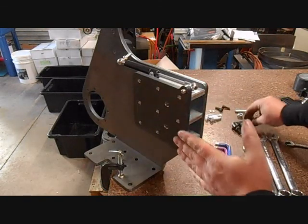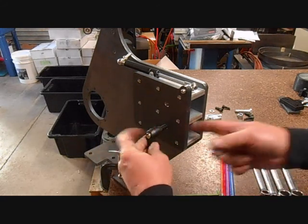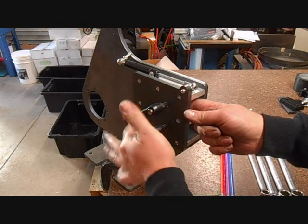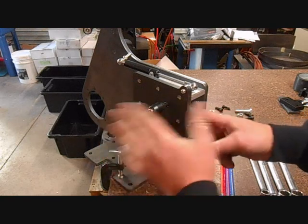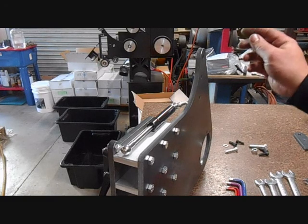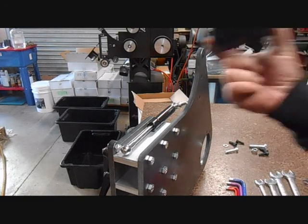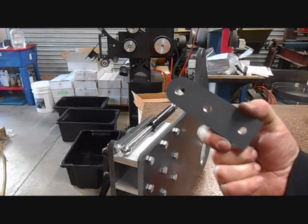Onto this side, you'll have two locking handles in the pack of fasteners for the body. They go in there. I'm feeling the inside just to make sure I don't go through, so there's not a problem getting the arms in. Now we need to put the tension arm on, or more importantly, the spacer and the left hand side that the tension arm pivots on.